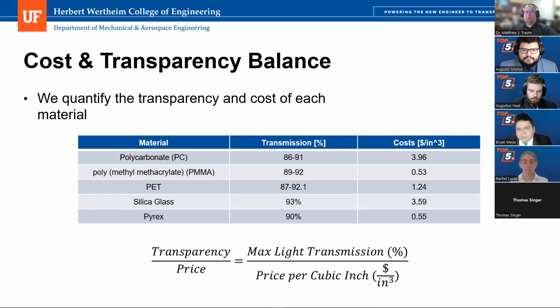of your cost is in the assembly labor versus 5% of your cost in the materials, ranking things on price when it's such a small component of your overall cost just doesn't seem like it's going to be that big a driver for a trade study. So something here that might have made more sense is, are any of these materials driving ease or complexity of manufacture or assembly? That would maybe be a better metric here. But I do like that you're considering trade studies and showing that.